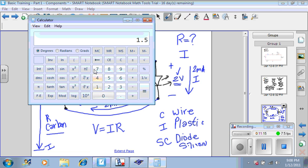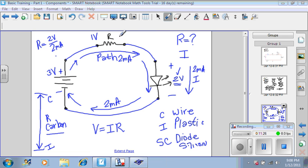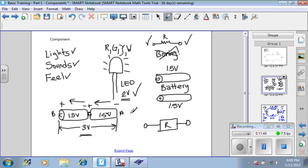After doing the math, I calculate this to be equal to 1,000 ohms. So I would go to the shop, ask the shop for a 1,000 ohm resistor, and I can complete this circuit. Here, I would basically take this and join it to here, take that, join it to one side of my resistor, and then take that to complete the path, and my LED will shine brightly.